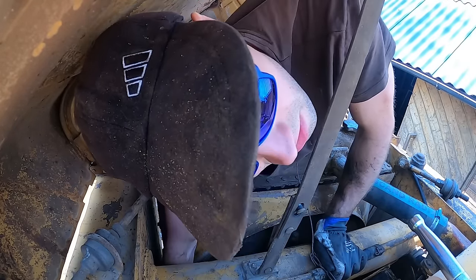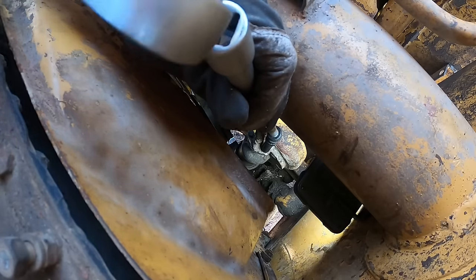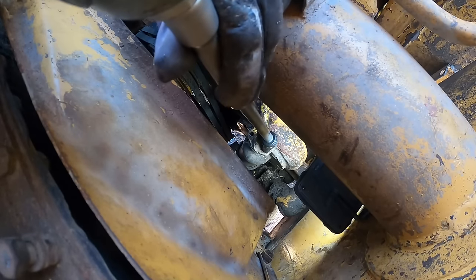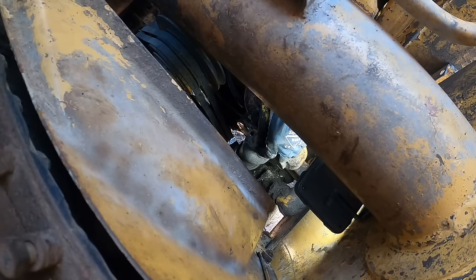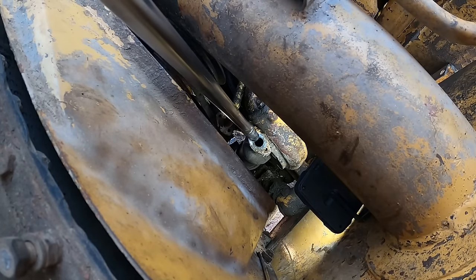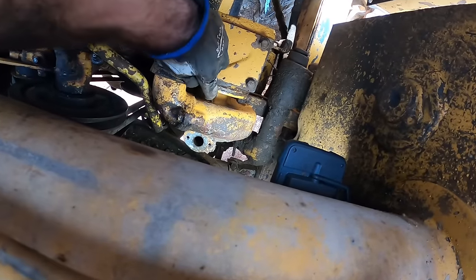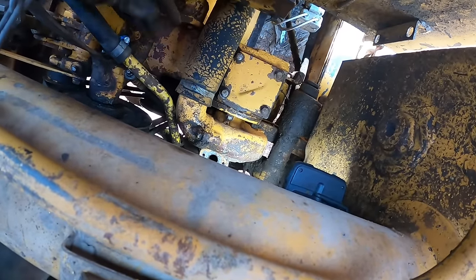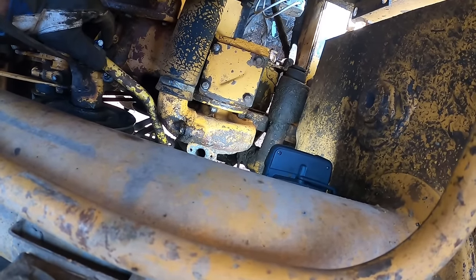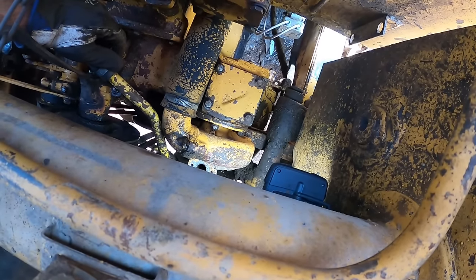Something's turning at least. Can't tell. Those bolts again. Great. You know, it's possible that it may have leaked through this area, but I don't think so, because the water was coming between this area. So it can either be this hose, but it was dry, I checked. It can also be this connection here, that was also dry. So I'm just gonna take the entire thing off, inspect it, and try to get some seals for it. If I cannot, then we'll go with silicone.